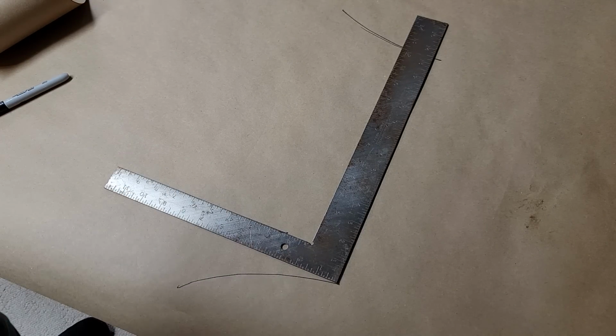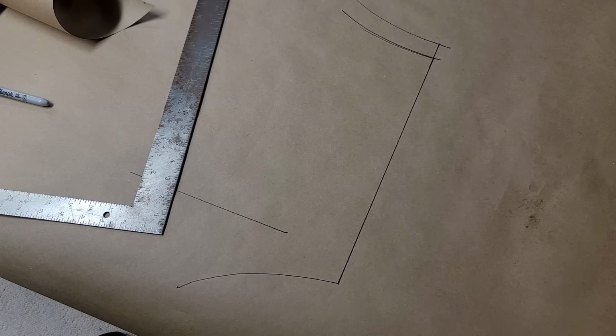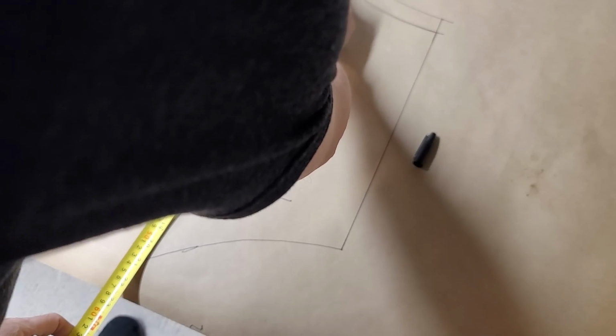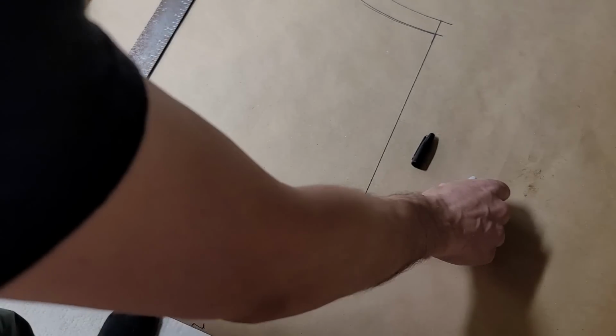All right, we'll just draw another line. It'll be fine. Just redraw this out another inch to 14 and a half. We'll retrace our 14-inch radius from that. All right, and the desired outlet width to make the outlet area double is 20 and a half. I suppose there's some kind of trig you can do that would define how far away this is, but I'm just eyeballing it. So I think it's about there and there. Let's just make sure that that is equal on both sides.